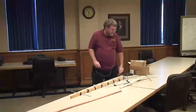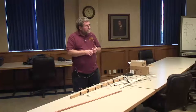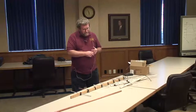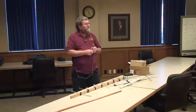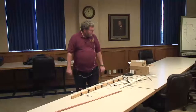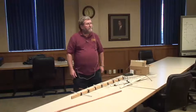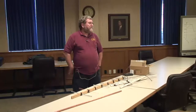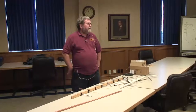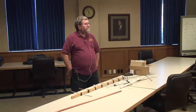There are a lot of other ways you can do the match. If you do a folded dipole, you wind up getting about 300 ohms, and in that case you need a balun that will transform — not only balanced to unbalanced, but also does an impedance transformation from 300 ohms down to about 50 ohms. There are also gamma matches and half a dozen other ways to match into the driven element. If you're going to design one of these antennas, I encourage you to do a little research. The ARRL handbook is a really good resource and several people, like in Project 3, have that book.